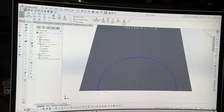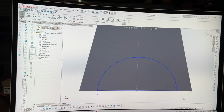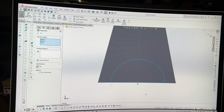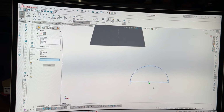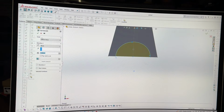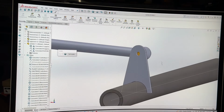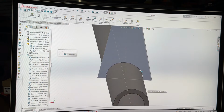I'll just do a quick little measure, because I think that's right. If I go 18.46, let's just center, let's just control X that, control V it, hit that, move that on the actual center of this line. In between circles because I think I mucked up a bit. Okay, exit, extrude, cut through all the way through. Thank you so much. Now it's a laser cut form, 2D banger. If we go through, looks like that. See, I was correct in it being the way it was.